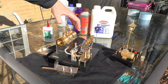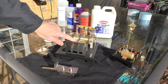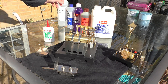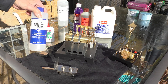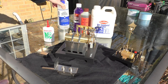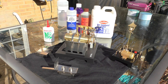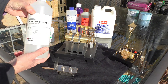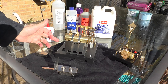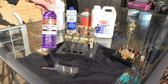When it comes to the fuel I've tried a few variations, because what you don't want — and unfortunately it's inevitable — is soot coming up and spoiling this really fine brass boiler. I've tried rubbing alcohol, which is very cheap and does work; this is 70% isopropyl alcohol. The higher the percentage of isopropyl, in theory the less soot you'll get. On the last one I bought 99.9% but I still suffered a degree of soot, so we're going to try the more traditional method and just go for methylated spirits.